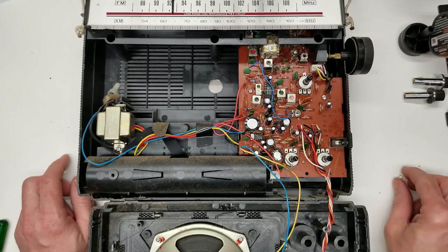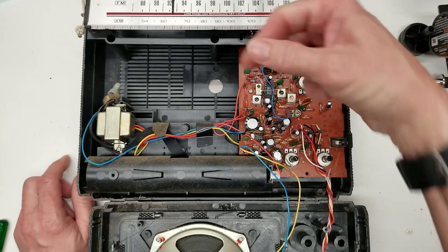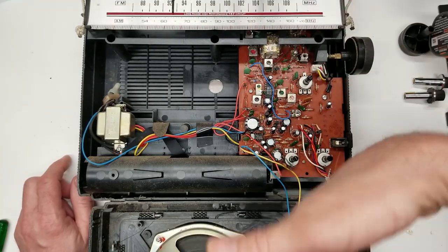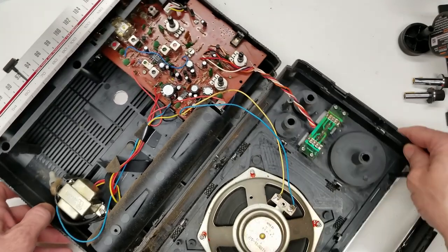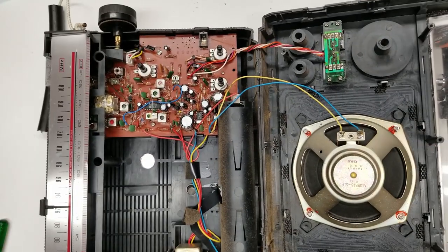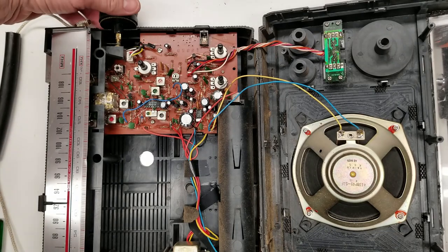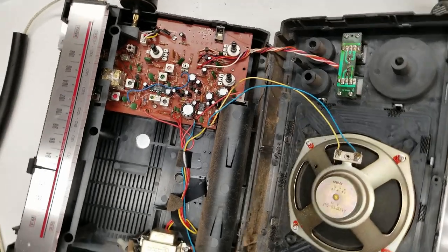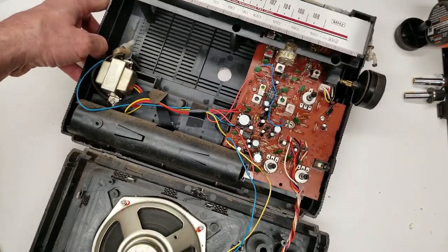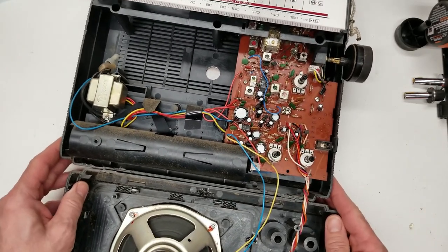Los Angeles is actually in this direction from me, and the antenna is receiving from east and west right now. But if I rotate this radio, I get so much interference from some kind of switch mode power supply that I really can't get much - just a constant hum. So I have to find the point where I can null that hum out, and that's unfortunately east-west.